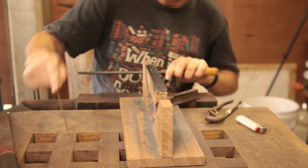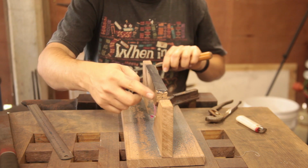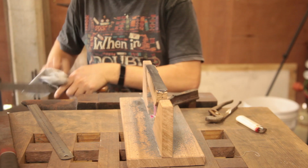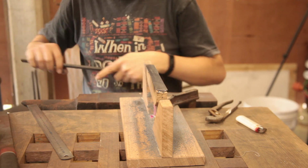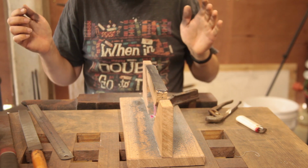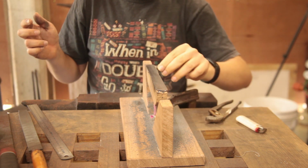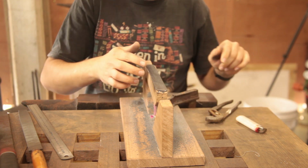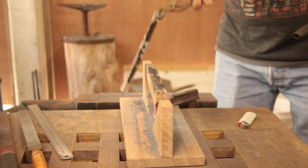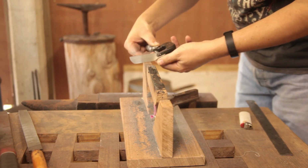Is done. So now we need to decide which is the cutting edge, strip that to flat, cut the ends to some nice round shapes, punch the hole, and then we can pack it in the case hardening medium and clay, ready to start drying out for case hardening in about a week's time once it's well and truly dry. Oh, along the way we've actually got to cut the teeth. There we go, just to clean up that side. It's nice and straight. Alright, let's have a look.